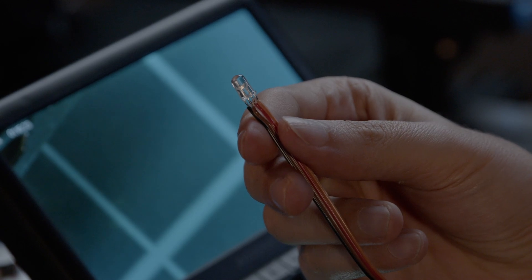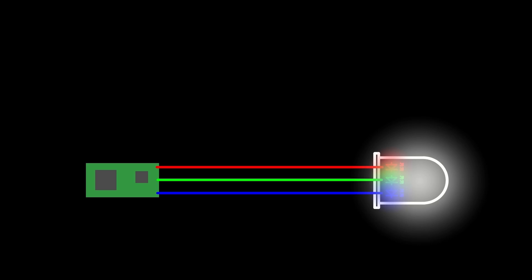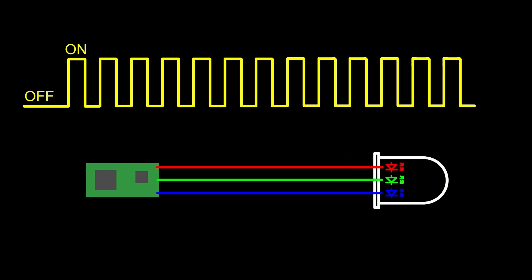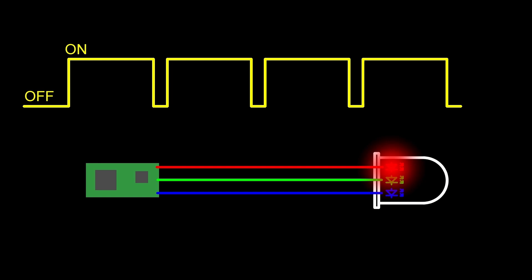Next, I need to learn how to control the LED so I can create nice light effects. Our LED actually has 3 small LEDs built inside of it — red, green, and blue. These are connected to the microcontroller, and if all 3 are on, the light will be white. To control the brightness, I am switching the LED on and off very quickly — so quickly that we can't see the flashing. The longer the LED is off, the lower its brightness; the longer it's on, the brighter it will become. I created some code with a simple light effect and it works.